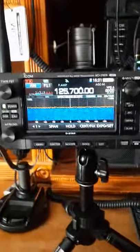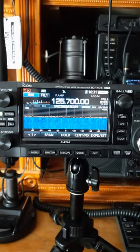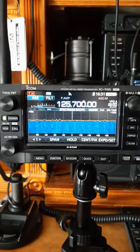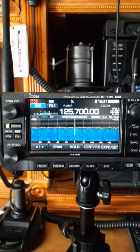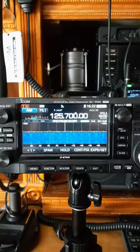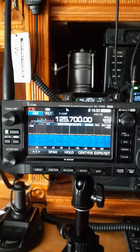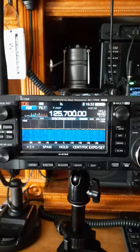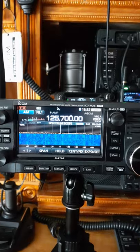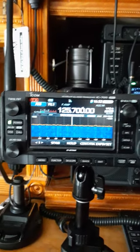I did do the MARS mod on this radio and it works quite well. It does go down into the 27 megahertz range and covers all of the amateur bands. You're driving along I-95 or I-80 and you might want to see what the traffic is - tune into channel 19 and there you go. You can listen to mobile VHF Marine as well as FRS and GMRS bands on here. These radios do not transmit there even when the mod is done. Don't go messing around beyond what the mod requires, because you might damage the radio.